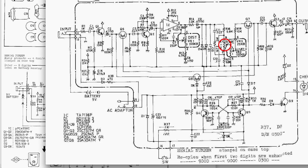We go out of that tone control into the level control, or volume pot. We exit the volume pot, go through the switch — assuming the pedal's on — and go out through a buffer to the output. So, the parts are different and they definitely sound different.